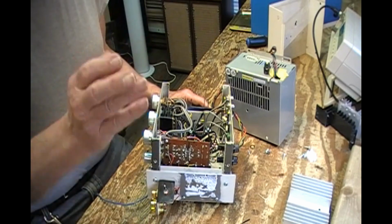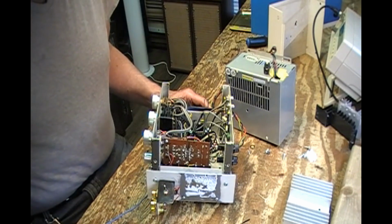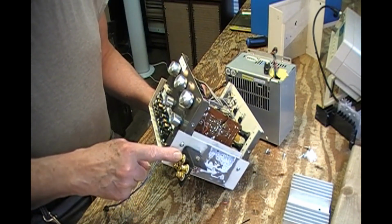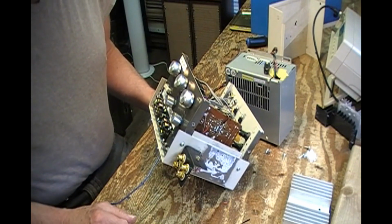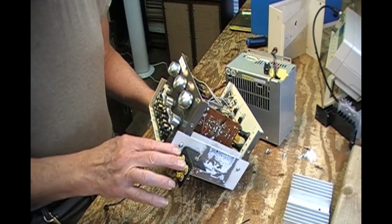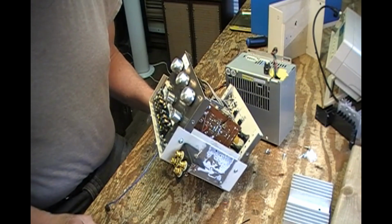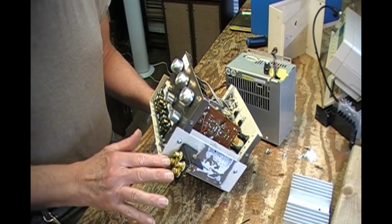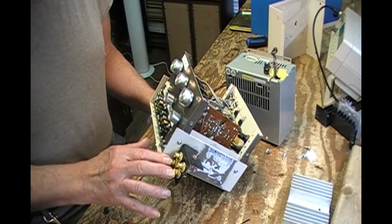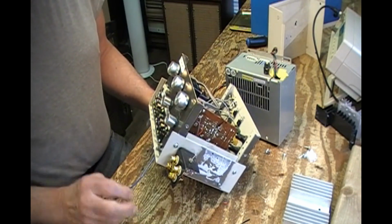And when that stopped being used and it sat there, I decided I needed a proper bench amp, and so here that is. So what it didn't have, and what I added externally, and what I'll be stealing these jacks for, is a break between the preamp and the power amp, so that the preamp can run out to a basic power amp only that I might have from a customer, and also to utilize the power amps that are in this if I happen to get a preamp that needs a power amp in order to test it. But see, it's outboard, and it works, but it's not so good.